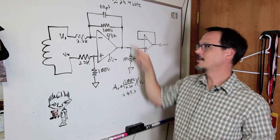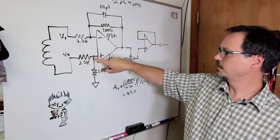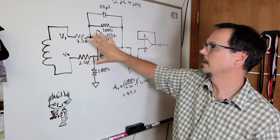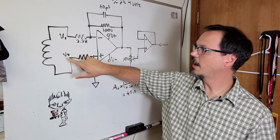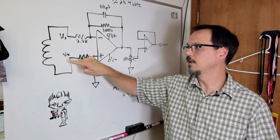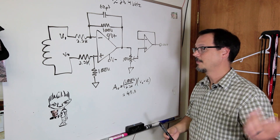One thing I can tell you is that set up in this configuration, I don't have to AC couple this. If this thing were referenced to a much lower voltage, you'd have to AC couple it in. That's a pain because then I have to start worrying about how a coupling cap is going to interact with the inductor — we talked about resonance before.